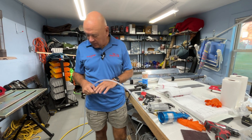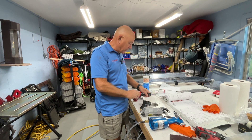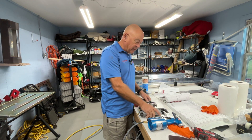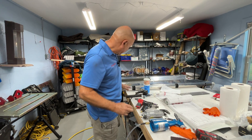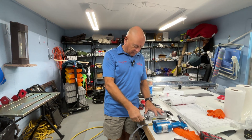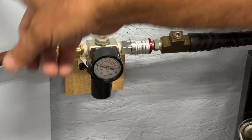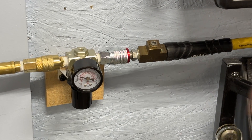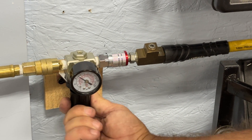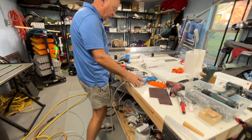My shop is off the side of the hangar, and when you go back and forth between tools — a rivet gun runs around 30-35 psi but squeezers run up around 80 or 90 — you invariably have to run back and forth to the compressor to change air pressure and let it bleed down. So I picked up a $20 regulator off Amazon and ran the air hose in from the shop. Now in the room I'm working in, I can quickly change the pressure right here. I leave the compressor above 100 psi and adjust locally.